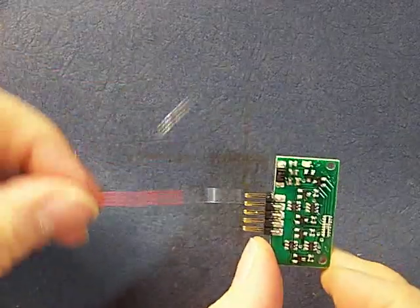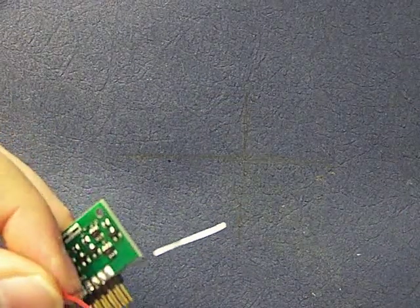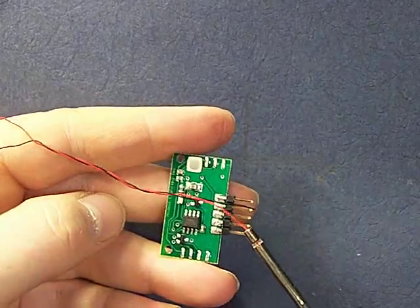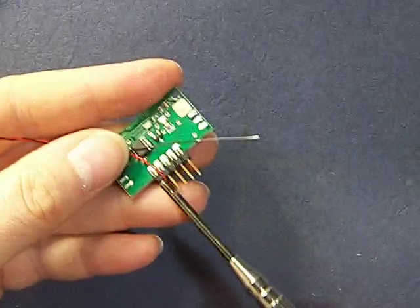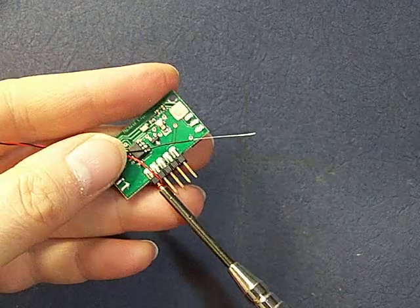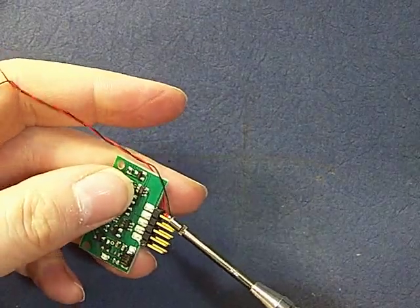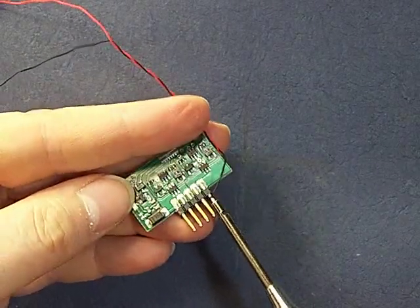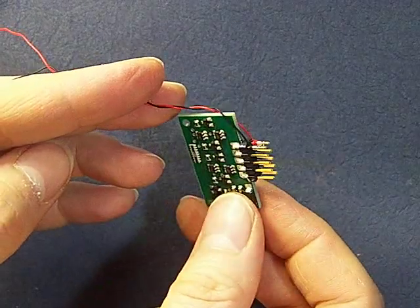Let's hook this up to the controller card. On the controller card, the red lead goes on the back side of the card. Some of you have parts on the back sides of your card, some don't — cards with parts on the back can do fancy special effects. I'm just going to put the tool on the post and wrap, wrap, wrap just like that. For LED strings the black wire goes on the front side post. Wrap, wrap, wrap. This is a good wrapped post because there's some insulation on the post, the wires are tight, and it looks neat. We're ready to hook it up.